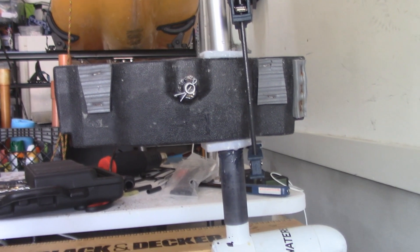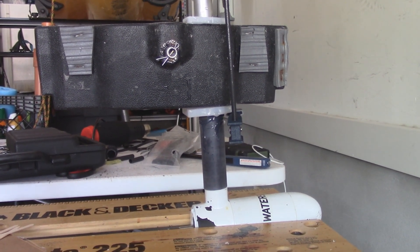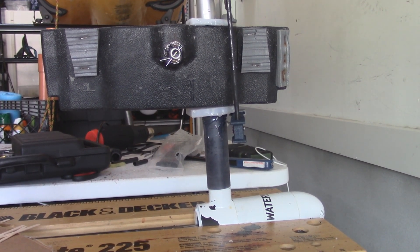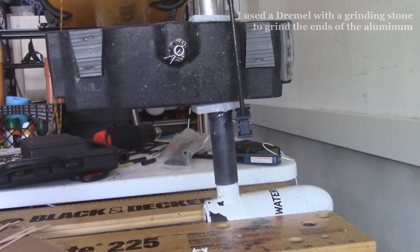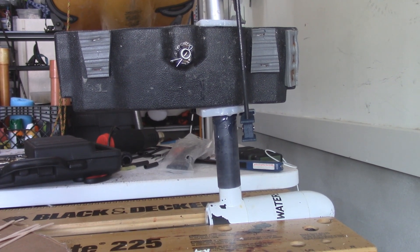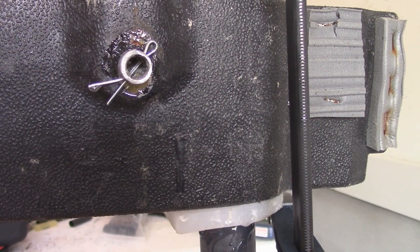The first thing I did was use the regular cassette and use a staple gun to staple some foam padding around the side that makes it fit a little more snug in place. Instead of using the stock cassette plastic tabs that pop off real easy, I got a hollow aluminum bar from Lowe's, cut it to fit — I think 6 inches — ground down the ends of the bar to fit in the Hobie feet where the kayak is. To make sure that bar stays in place, I used a cotter pin — drilled a hole right towards the end of where the cassette is, and put the cotter pin through the hole, as you can see. I've also epoxied around there to make it a little more waterproof.